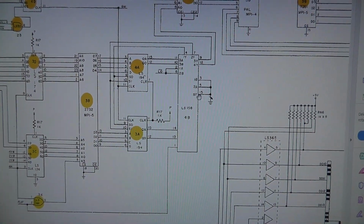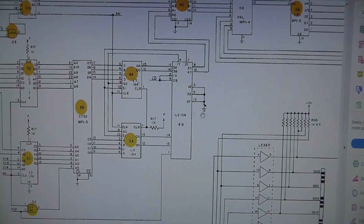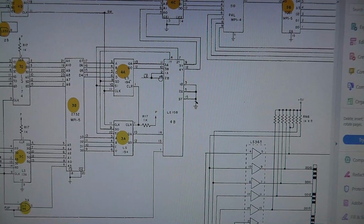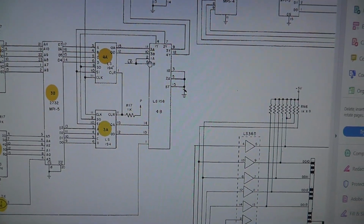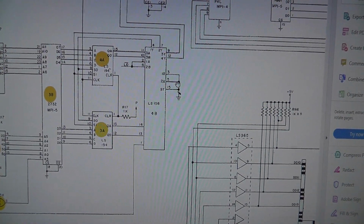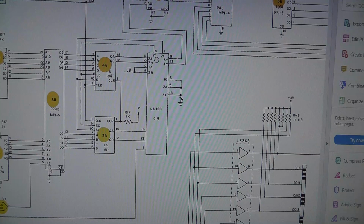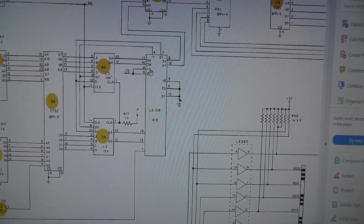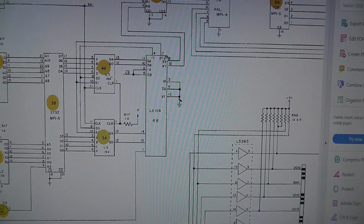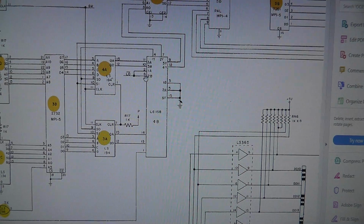Alright, so I think I made a lot of progress off camera. I was down a whole rat hole on testing proms and stuff, but I'll come back to that. So I basically made the wrong conclusion here. The key here, if you can see it, is yes, pin 2 and pin 6 are tied together, and pin 3 and pin 5 are tied together, and those both drive those outputs. But the difference is one Y output, pin 4, 1A, the A is on load and the B is grounded, versus 2Y, A is grounded and B is tied to load.